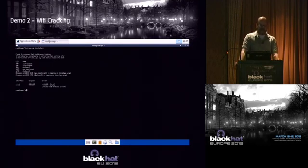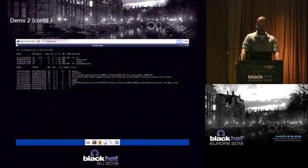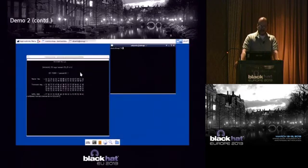Let's do a little Wi-Fi cracking. All right, so run airodump. And here's my network at my office, which is a lot less busy than the network around here. It's just a few access points around here. And I ran aircrack, and sure enough, wise men think alike and choose what? Password1. So Password1 was the password for this WPA2 network. Okay.